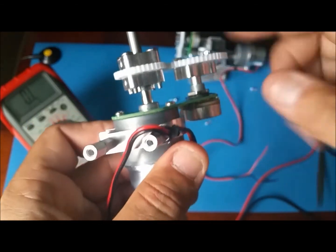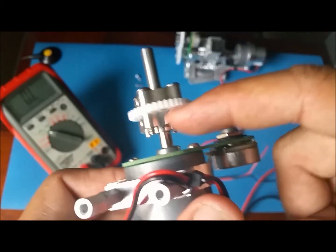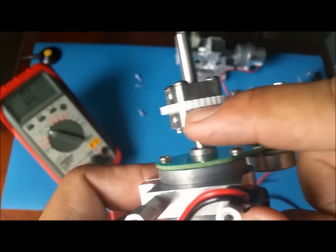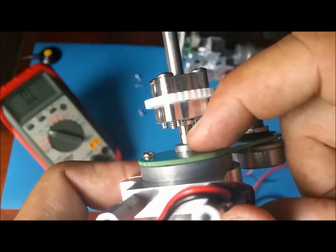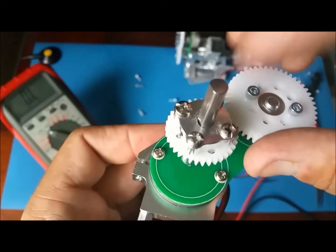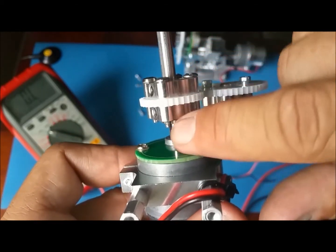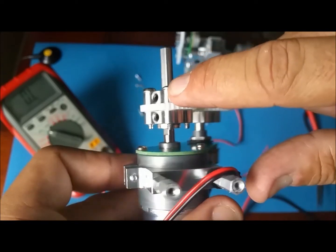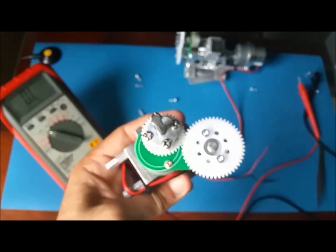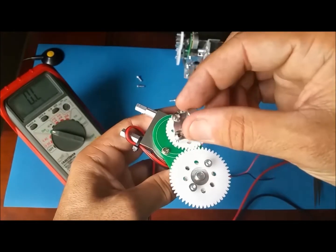Have this one ready. I went ahead and attached this one. Remember I said there was one of the hubs with a smaller diameter, this one here on the bottom that attaches to the motor. That one, the diameter is smaller. This one is 1/4 inch. And again, I have the screws that go all the way to touching both hubs. So this is your Azimuth assembly. Okay, 5K.